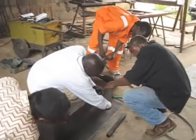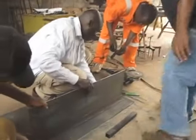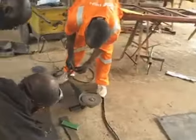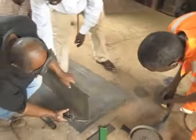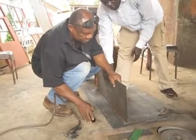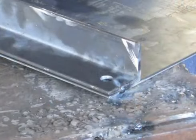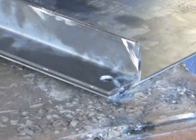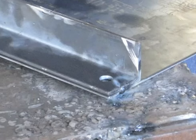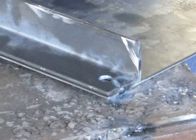The second option is to drill pilot holes that are less than 11mm in diameter in both the angle iron and sheet metal. This way you can line up the holes more easily when it comes time to assemble the mold. The third option is to simply mark where you will be drilling the holes and do the drilling once you have the pieces clamped together. You can't use a drill press if you choose the third option. You'll need to use a handheld drill instead.